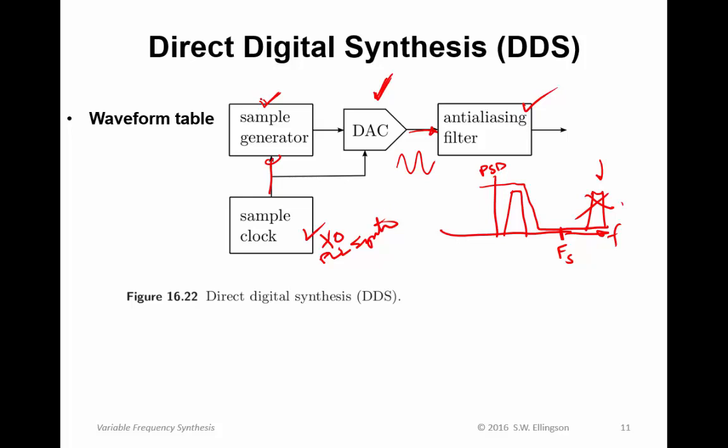There are different ways to generate the samples. One approach is the waveform table: to make a sinusoid, you sample it at a certain rate to get the values, store them as a table, and cycle through them. You must be careful that the last sample in the table connects properly to the first sample — a glitch would be disastrous. Another approach is CORDIC, an algorithm that generates sinusoidal samples without actually listing them all out. The advantage of CORDIC is that it requires no memory for a table of values — sinusoidal signals can be generated purely through calculation.